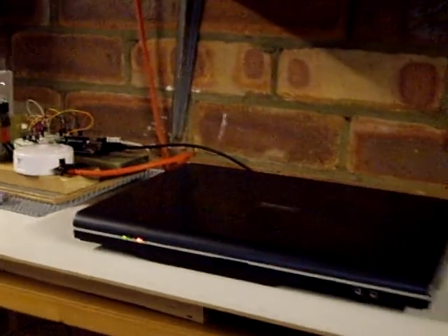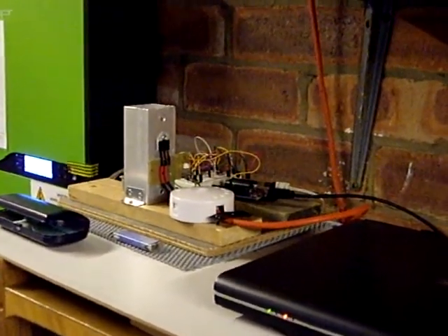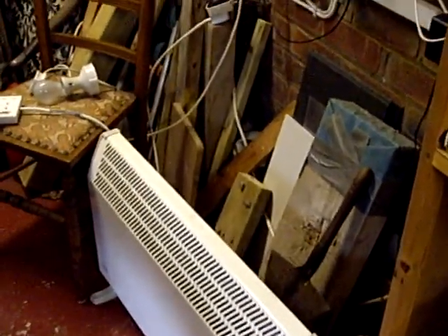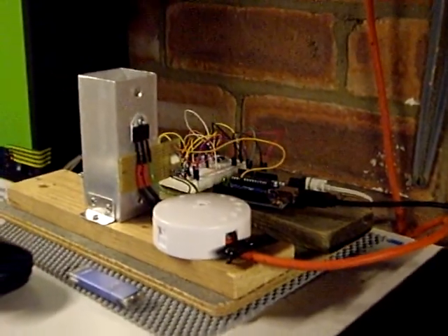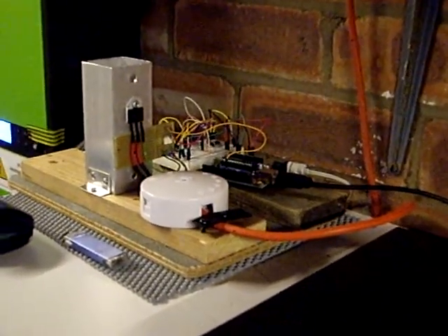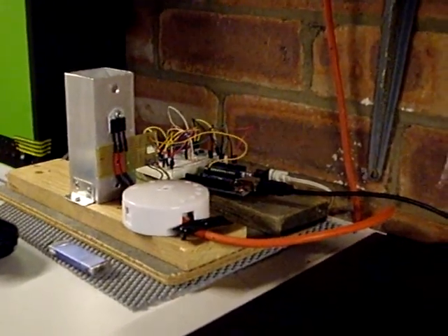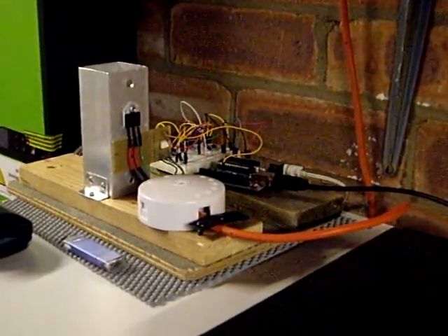I put it on the laptop here and ran it in the mode it's posted in, which is called Tally Mode, which is good for calibration. I calibrated it using a 3kW heater here and found that the calibration for the rig — which is still my original prototype Mark II — was a few percent different from the nice PCB version inside. I'm now running with a power cal factor of 0.065 as opposed to 0.061, but it's very little different.